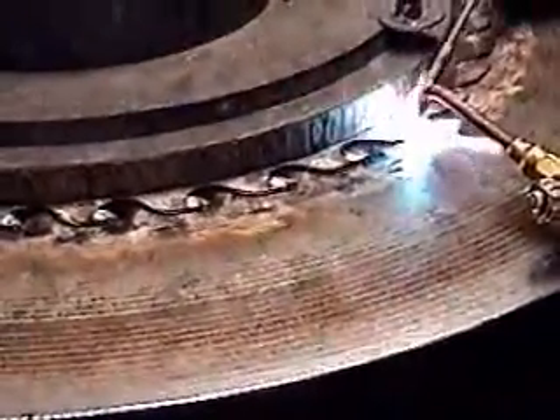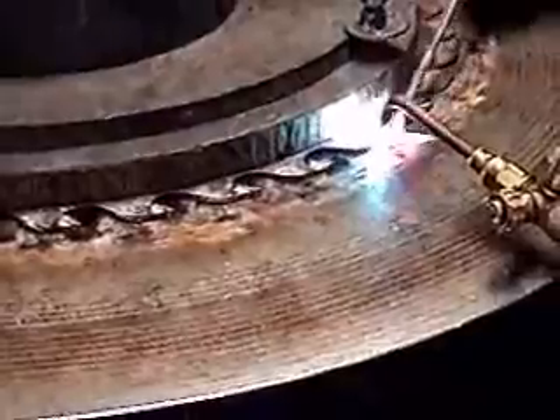We found out with this plate on top and everything laying flat that we don't hardly have any problem with the heat. It releases the tension that's in the saw. After we tip it, we'll let it lay there until it cools down. That plate absorbs virtually all the heat from those teeth, and it does not add tension to the saw.